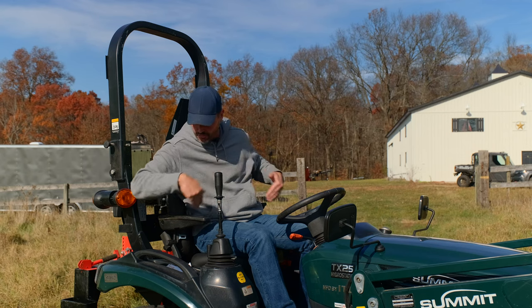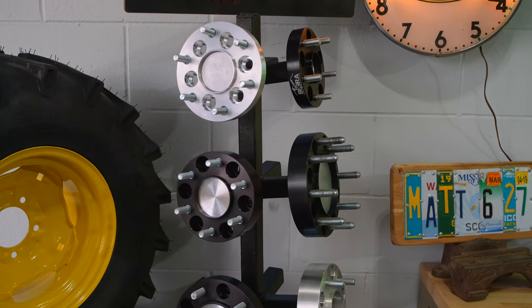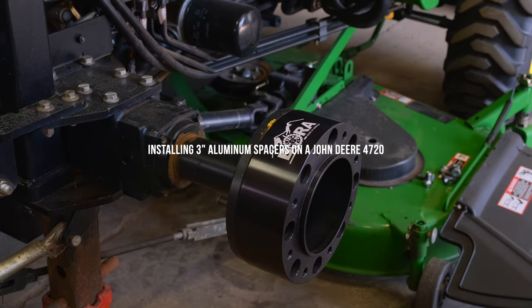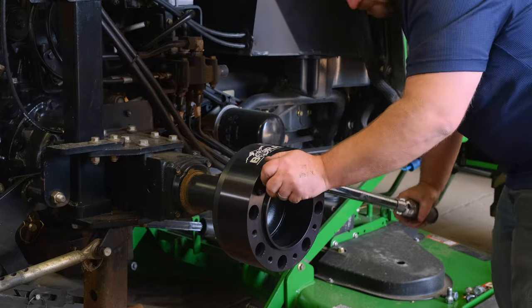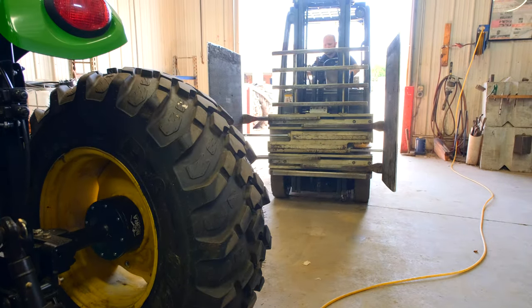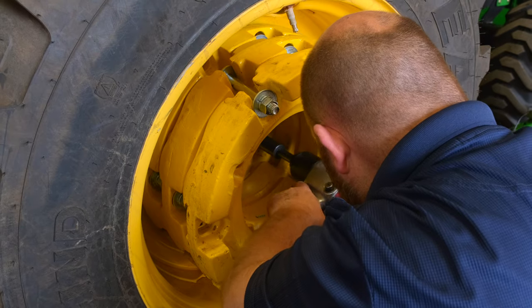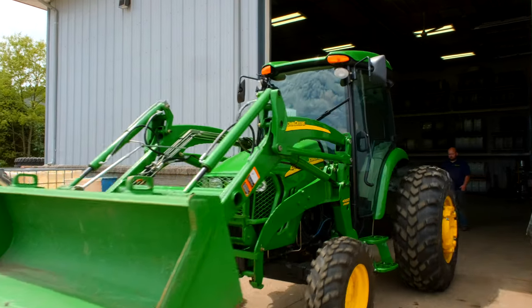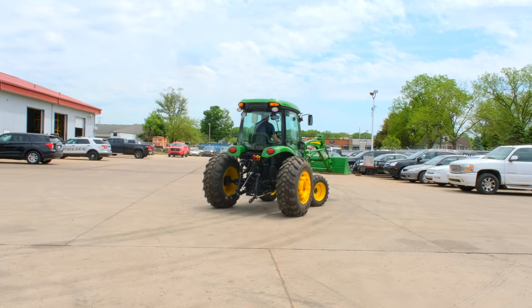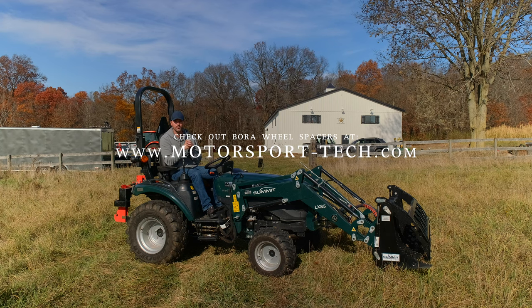We have one more option on the rear axle: wheel spacers. Wheel spacers are good for a couple of reasons. Number one, they're widening the footprint of your tractor, and a lot of these tractors are tippy side to side, not just front to back. The bigger you go, the more stable they are naturally, but the smaller the tractor, the more narrow and tippy side to side they are. Wheel spacers spread that out. If you get steel wheel spacers — I do prefer aluminum since they're less maintenance — but steel will give you the most weight as a spacer. On a small tractor like a 1025 or BX, not a lot of weight, but on a 3 or 4 series tractor, those pounds really start to add up. Bora is still a sponsor of ours and we're proud to have them on board.